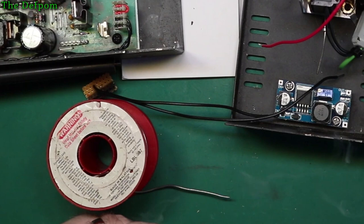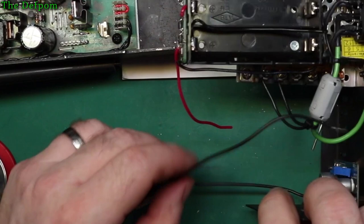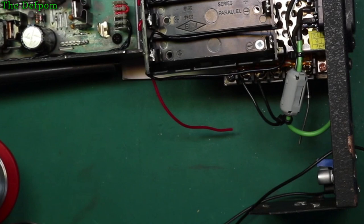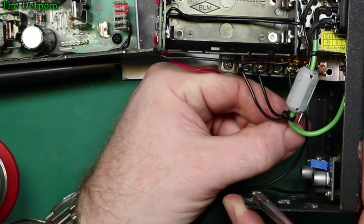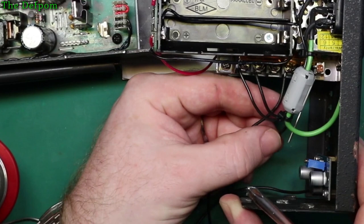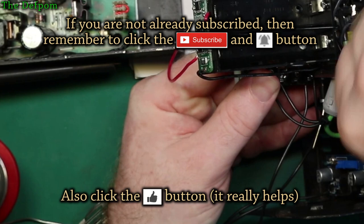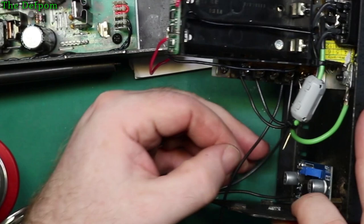Right, so shove those in that power supply connection to make sure we get on the negative, not the positive, because it's bad. So one from there. So shove one in there. Right there. Right, have to make sure we don't clamp on the insulation. Have to make sure I only get the wire. So put those out slightly. There we go. Always give them a tug to make sure they don't fall out. If they fall out, then it wasn't any good in the first place.